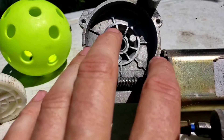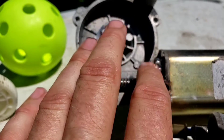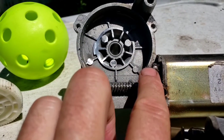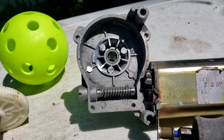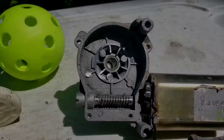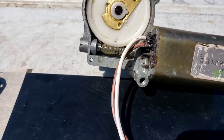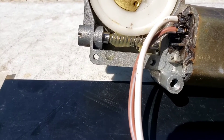Then I'll come back in, solder some wires to these contact points, along with some bypass caps to help make it so it's not noisy when it switches on, off, or reverses, and get ready to install it onto my pan-tilt bracket. So I got the motor all cleaned up and put the gear back in and soldered these wires on to test it, and showed that yes, it's now running continuously.